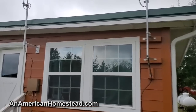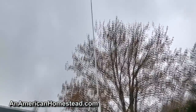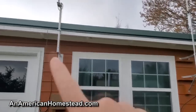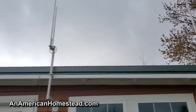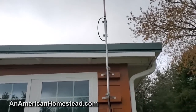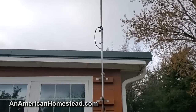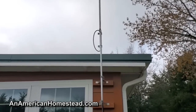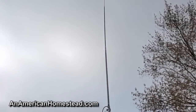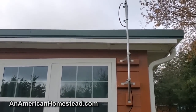Here's the side of my house and I have two antennas. This one here is a double J pole and this one here is the A99 — a lot of you guys are probably familiar with this one. It's a very common antenna for HF and CB, and I'm using it for CB. This one I'm using for VHF and UHF. Everything is working fantastic. And because I'm at such high elevation here in the Ozarks, sitting at about 2,300 feet, I've been able to listen from coast to coast — people in New York, the West Coast, the Mojave Desert, even down in Mexico. I'm only running a basic CB with four watts of power, so I can't transmit very far other than local.